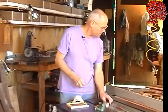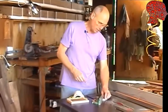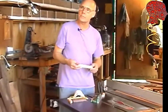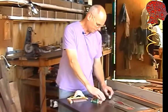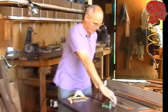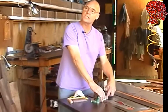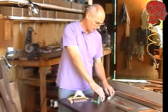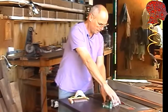At some point the piece gets too short to have a really solid foundation here. So if it gets shorter, take another piece of wood. It can be a scrap off your table saw, it can be a piece of what you're working with, and put that as an anchor, and that becomes the fence, and you can extend it out till it gets close, and then you can put this piece against it, and as long as you've selected a nice straight piece of wood, that's going to help you out. And then it's got support right down to the blade.